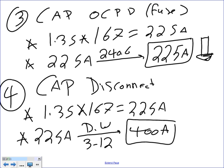So just to summarize, guys, we did size capacitors for switchgear at the level of the service entrance, and we size the capacitors at the level of the offenders, which is mainly motors. We can size capacitors in between, too. You don't have to go to the main or to the motor. You can go somewhere, say the mechanical panel, and add a synchronous machine right at the mechanical panel. If you size the synchronous machine, it's the same process, the same calculation, except it becomes a motor here.